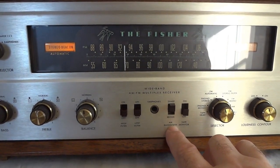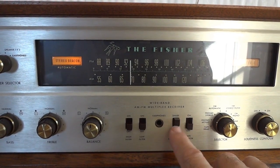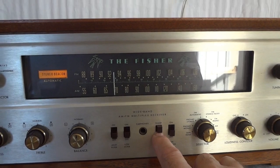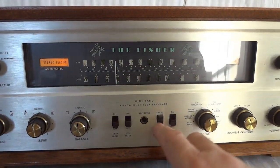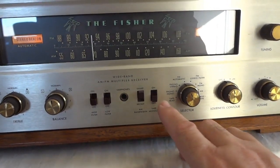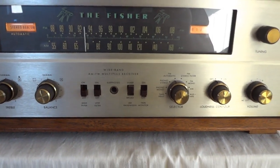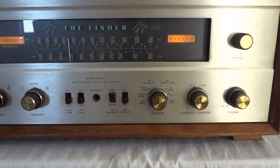This is for AM — amplitude modulation broadcast band. You can go to narrow or broad. They call it sharp, but they mean sharp in terms of the audio you will get. In reality they narrow the RF bandwidth, and if you go to broad the RF bandwidth is widened and you get more highs in your signal on AM. Tape monitor was basically used to monitor recording as it was being recorded — not really used nowadays since nobody has a tape deck anymore.